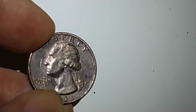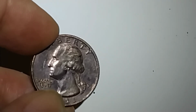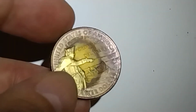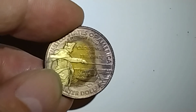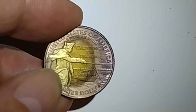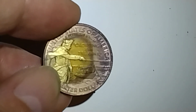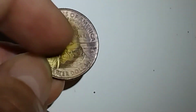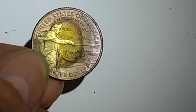I guess I'm going to post another video with a more successful plating, but I will just show the result. The method is the same. My electrolyte wasn't concentrated enough. Another possibility is simply to use copper sulfate as the electrolyte. I just wanted to use baking soda because it's so cheap, and when it's well done it works almost as good as copper sulfate. But copper sulfate is not very expensive. You can get 2 pounds for $15 at Lowe's, and maybe you can even find it cheaper online. Okay, but the result is not bad. I mean, it's pretty actually.